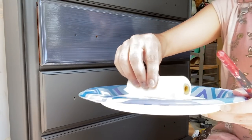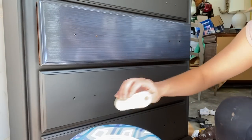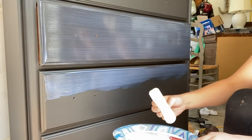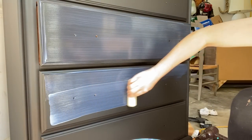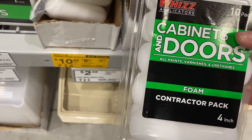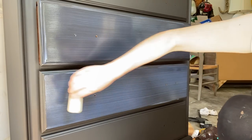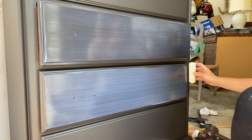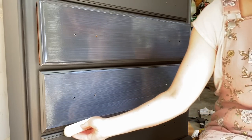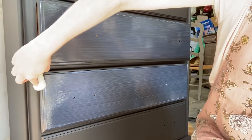Another thing that many of you guys found me for was using this technique — just because I have ADD and I'm always trying to do something weird and save time — I found out that these foam rollers really work well for applying top coat, avoiding streaks and bubbles in your finish. I like these Whiz foam rollers specifically. On the edges, it's so easy to clean up any drips; you can just dab to remove any excess clear coat that gets gathered on the edges, and then you just go straight across.